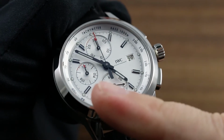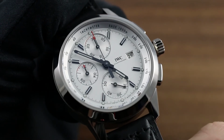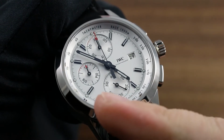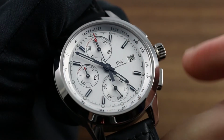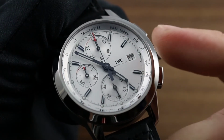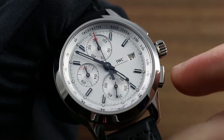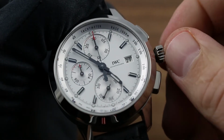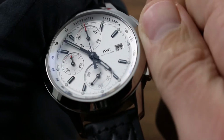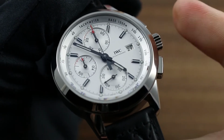However, take note, between the hours of 8 p.m. and 3 a.m., the watch's automatic date jumper is engaged. So from 8 p.m. to 3 a.m., the watch is changing its date as it turns through midnight. Don't use the quickset from 8 p.m. to 3 a.m., as attempting to do so will crash the movement and cause significant damage. Always take the crown and thread it down when you're done using it for security against impact as well as water.